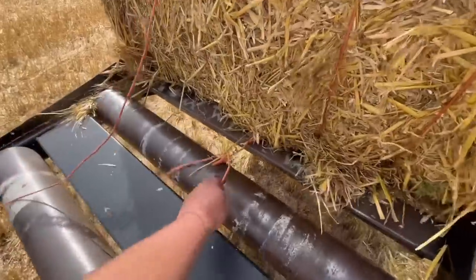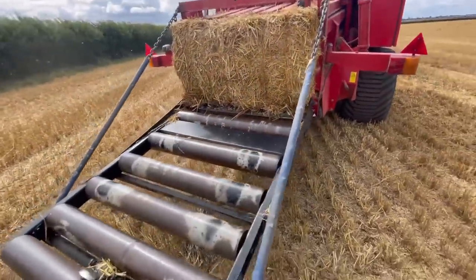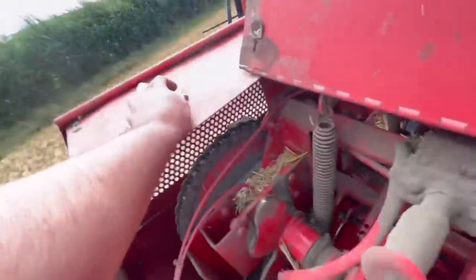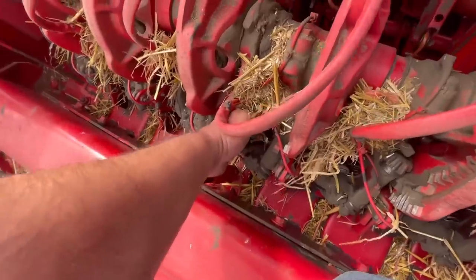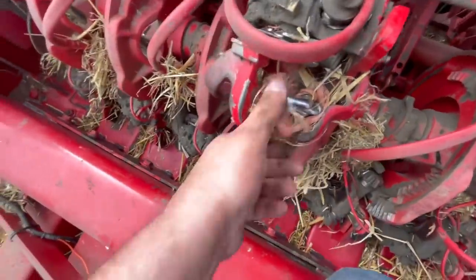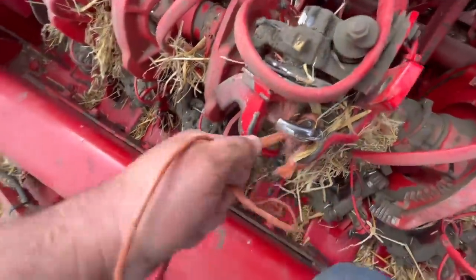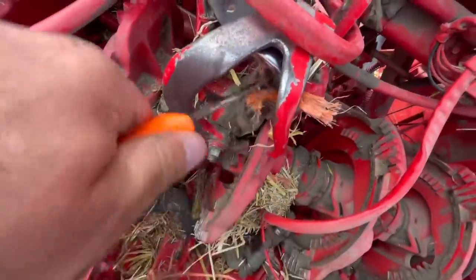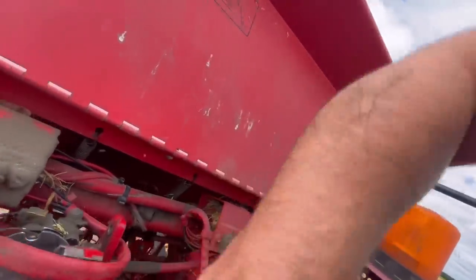A little bale — a little string snap. I've never really had that happen before. You can all just sit and watch me re-tie and get caught in it. First job — there's a string just there, you need to re-tie it at the top and the bottom. I have to pull this up — just watch it because there's a thing under there that hurts your fingers. There is the problem — that's just come out of there. Just pull this off and get rid of this, just pull the string. We're going to tie it round here like that, just get that last bit of string out so we don't keep blocking it up. Must have had a little bit caught round it and then it just got a little bit bigger — but that's the first time that's happened to me.